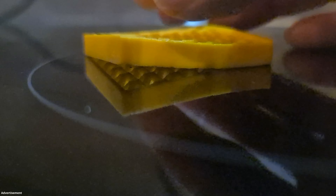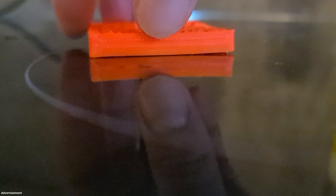Let's take a look at how the individual materials have survived this test. In yellow we see standard PLA — after the dishwasher test, we see a strong distortion. Despite its solid construction, this part is no longer usable. PETG shows a slight warping — not traumatic, but a slight warpage is definitely present. Overall, I think PETG did quite well. PLA+, post-crystallized: no warping at all, looks very good. PLA+ non-post-crystallized: slight warpage visible. ASA: no warping at all, very good. ABS also shows no warping — absolutely nothing to see. I would have been surprised if it had been otherwise.